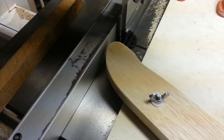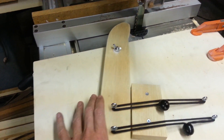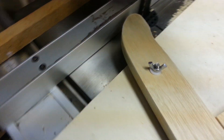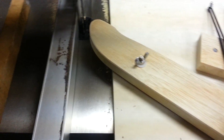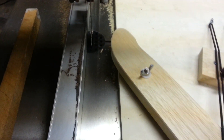This way I could send any thickness through, and I could also adjust the fence without having to worry about the feather board so much. It's within range — I could basically send anything through there from quarter-inch material up to two and a half inches thick, and it will accommodate it without me having to move it around.